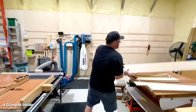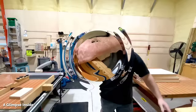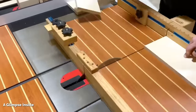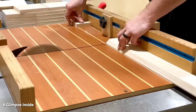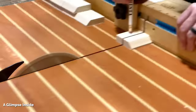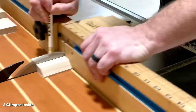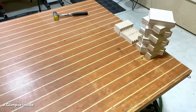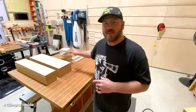Now it's time to cut all these pieces to length. Now it's time to cut these six-inch individual blocks — six by six — on the crosscut sled. These are going to be the left and right sides of all of the shelves. I'm trying something different with these shelves — I'm not going to put an entire 45-degree angle cleat along the entire back; I'm only going to use these three-inch sections. I'm just cutting them in half, giving me the bottom support as well. We've got eight pieces — tops and backs — and then we've got our sides and all of our cleats. What you see behind me are all the pieces needed to make these eight shelves: the backs, the tops, the sides, and all the cleat pieces.